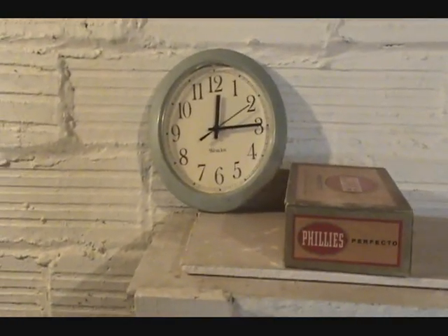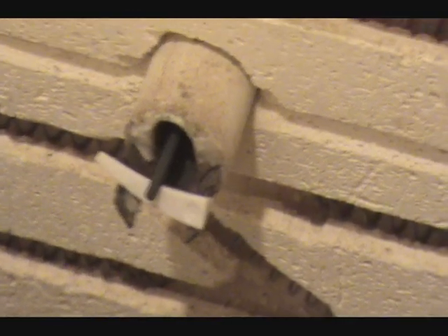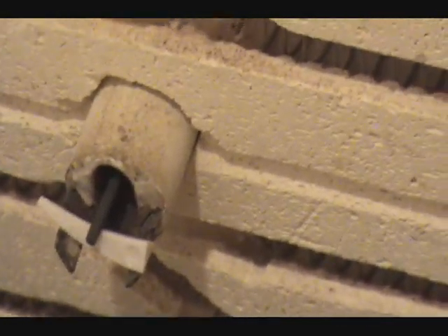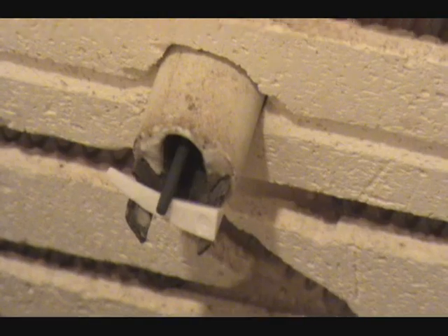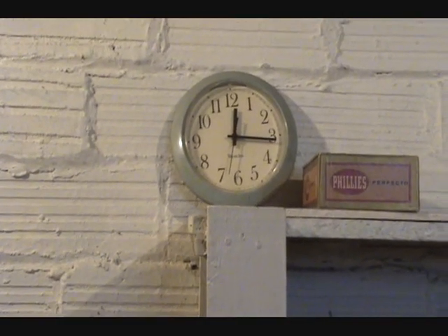It's quarter after 12 noon, the next day after when we started, and the kiln is finally cool to the touch. I can see that the cone is bent — that's what caused the lever to drop down and the light to turn off initially. So there you have it from beginning to end — not quite a 24-hour process. Now you know how to fire a traditional electric kiln with switches only. One last thing I always do at the end: turn everything back to the off position. All four switches off — the right hand is off on my kiln — so that the next time I come down, everything's ready to start new.